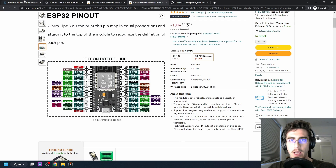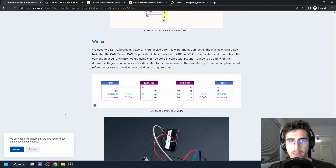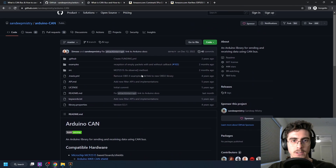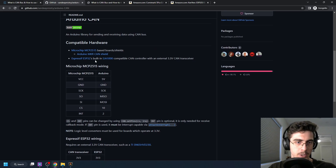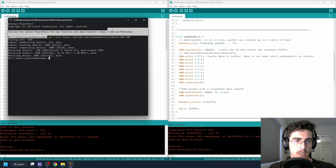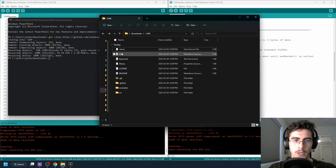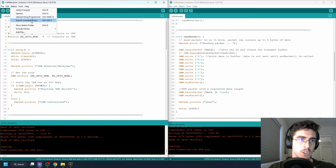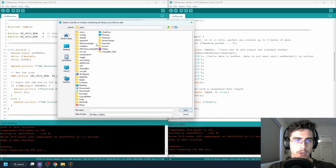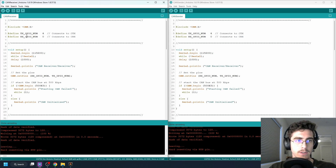We're going to need a CAN driver for the system. Luckily, the reference article links to a GitHub repo. I was reading the README file — it says it works with ESP32, great. So I just git cloned it and installed it as an Arduino library. You do the git clone, put it in your downloads folder, then go to Sketch → Include Library → Add a ZIP Library, and navigate to where you installed it.